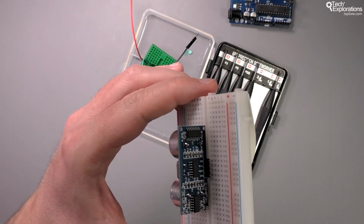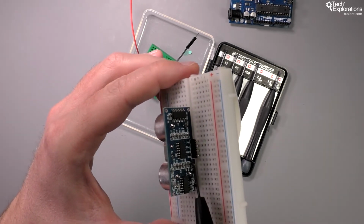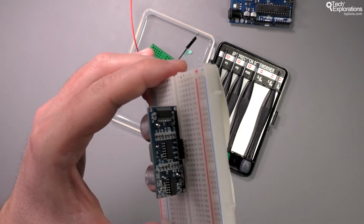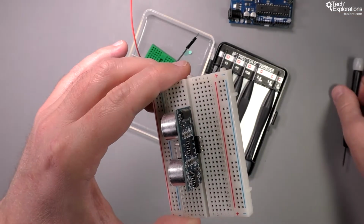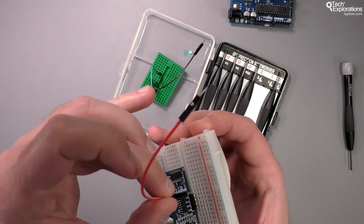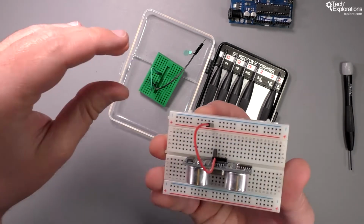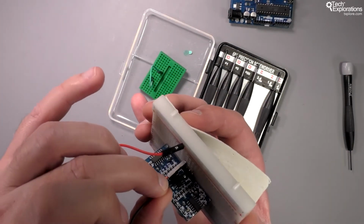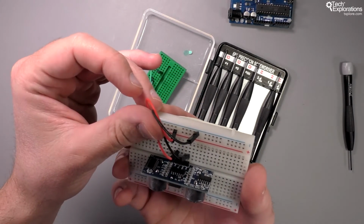You can notice that there is a ground pin and a VCC pin. Ground pin means 0 differential, and VCC pin means 5 volts for this particular sensor. So I can plug in my 5 volts power to this device and then use jumper wires to connect this power to my connected device like that. So that's 5 volts, and there is my ground connected like that.